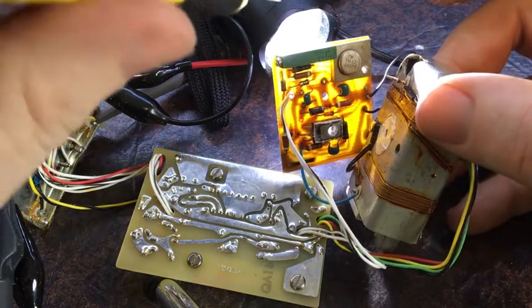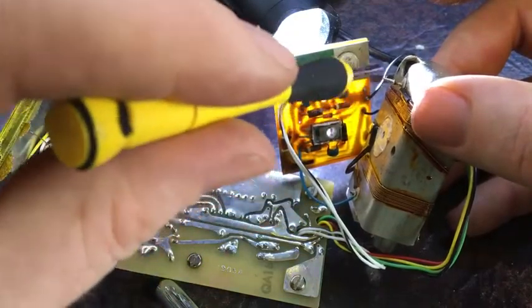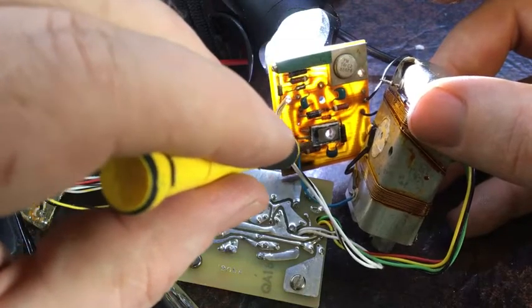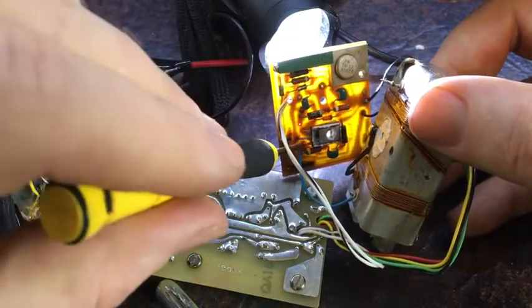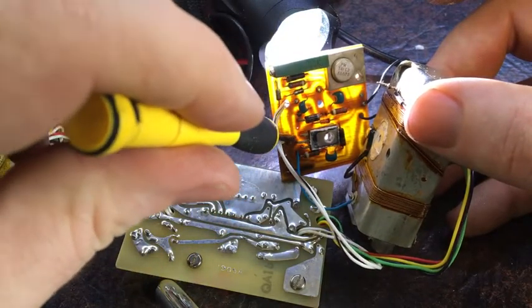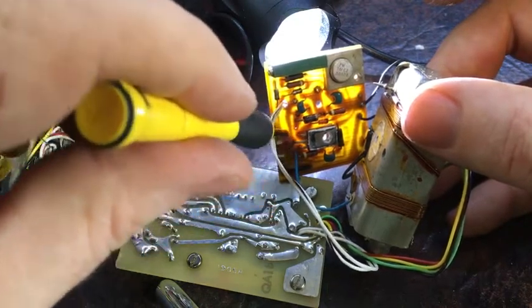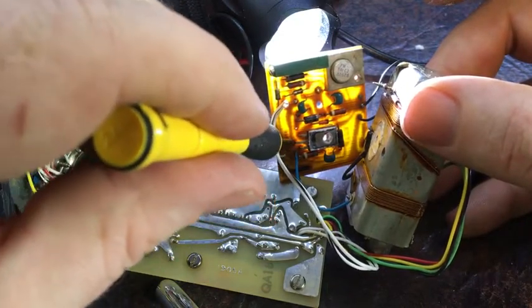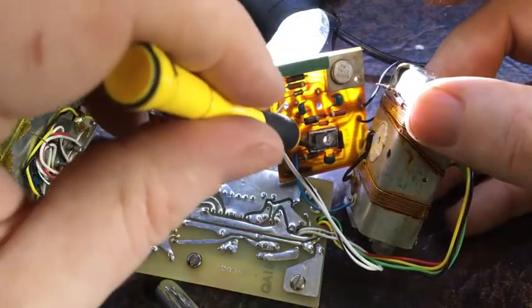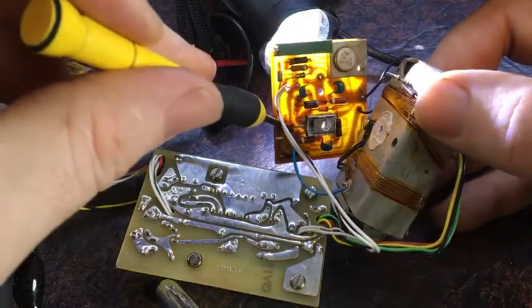Okay, right, I know what they're doing. So you've got 24 volts coming in this pin here. Well, 22.8 volts. Pass through the coil back to here, to this device. That device, when it's not heating, is turned off. And so you're measuring 22 volts or so there. But what it does when it turns on, obviously it shunts it, tries to earth that, or connect it to 0 volts, which causes this device to heat up because it's switching and heats the coil, so it's using that spare energy to heat as well, which is quite good. So none of the energy is actually being wasted.